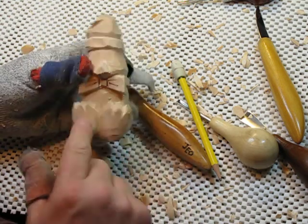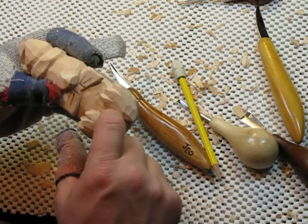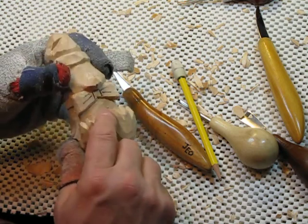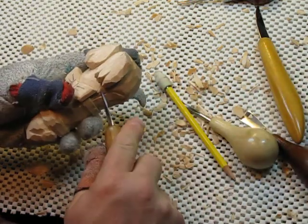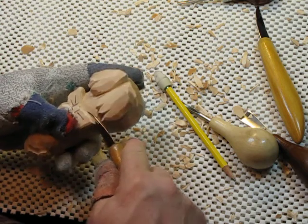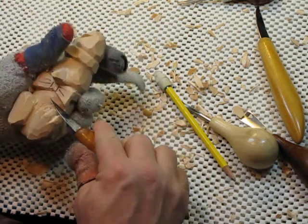The cleanup I'm going to do is little things like these little gouges back in here. You surely know how to do that. Take your knife and clean up. What I'm going to do is use a flexible knife to get in there, and I'll take care of all those little stray cuts, and then we'll come back and we'll see if we can't finish this thing up in the next video.